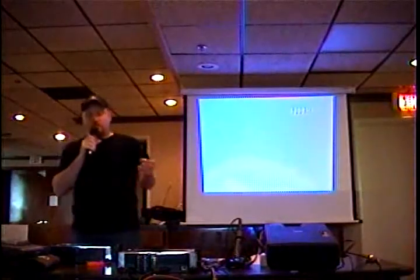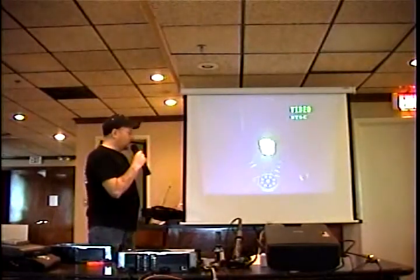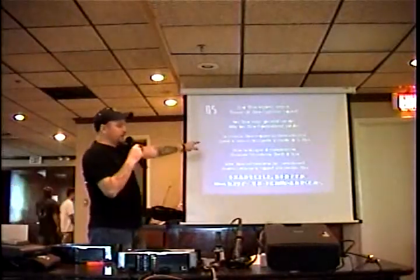Anybody who wants to come up here and see anything, if you want to play around with the Xbox, feel free to. Oh, but one more thing that I wanted to show you. I talked about the red and green light flashing, but you may get something else. I've set my Xbox up here, and I'm going to hit the switch. I have made changes to the dashboard on the retail BIOS portion of this so that it comes up to an error. It comes up with what they call the flubber screen. It shows the Xbox logo, and it goes to this error message.